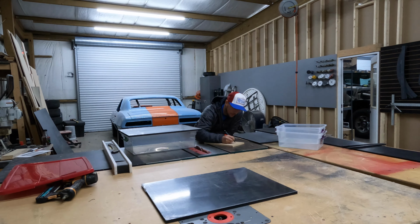So we've got 6 3/8 times 7 areas. That's 44 5/8. We've got our half inch pieces. There's going to be 8 of those for our shelves. So we'll have 7 shelves in the top. So that makes 8 times half inch is 4. And then the bottom down there that I was just telling you about, that's going to be another 4 inches. So that's going to equal 52 5/8 inches. So that's what our sides will be cut. And then we'll rip them down to the 2 measurements I told you a second ago, the 8.5 and the 4. And that'll be our sides.